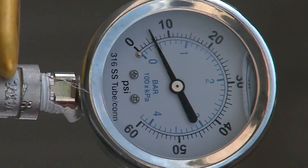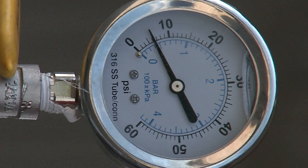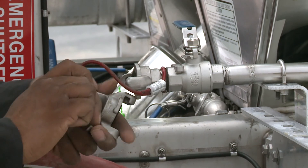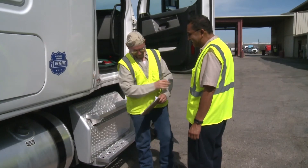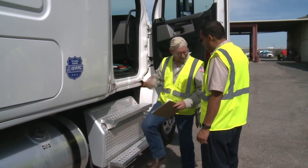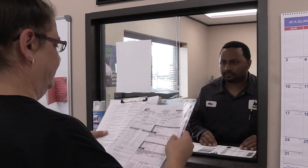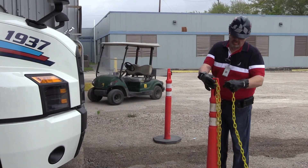Recheck to see that the tank truck is still pressurized, usually with a minimum of 5 to 10 PSIG of nitrogen or dry air. This will help ensure that moisture will not enter the tank truck and react with the residual TDI on the return trip. Finally, depressurize and carefully disconnect the dry air or nitrogen hose from the tank truck's inlet valve. Then replace the dust cap. Return the empty tank container with a positive pad of dry air or nitrogen gas. Sign the delivery report and note any unusual problems or delays. After removing the barricades and wheel chocks, the cargo tank trailer can be released.